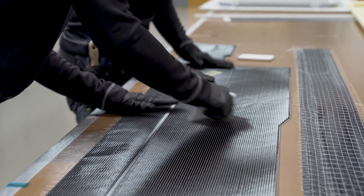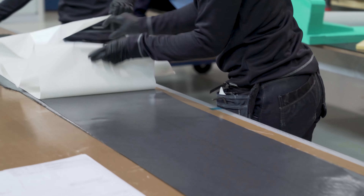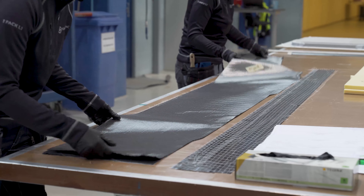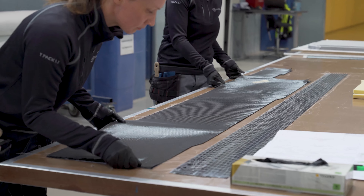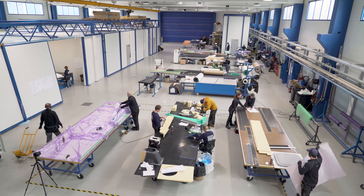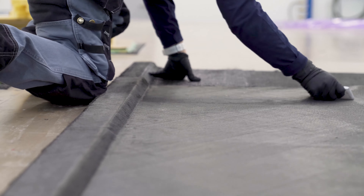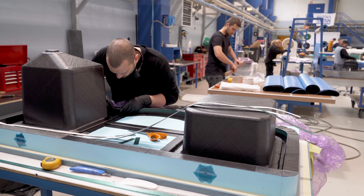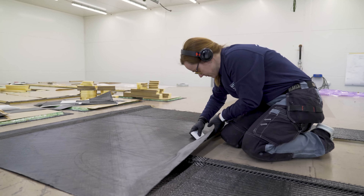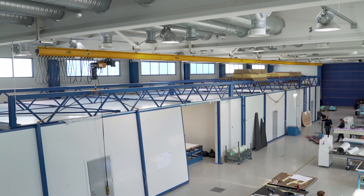The materials here need to be handled very carefully. The resin is injected in the factory, delivered here by freezer truck in order to get the optimal carbon-to-resin ratio. It is then put into our freezers on site and only comes out into production when needed. In this facility we have developed a system called S-Sync — I can't say too much about it, but it revolves around the various materials being cut in their pre-cured state by machine, allowing us to build very high quality, accurate parts that would not be out of place in a high-end racing yacht. This is something we are very proud of.